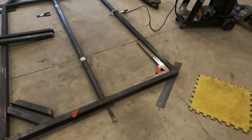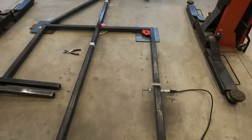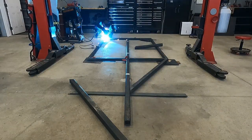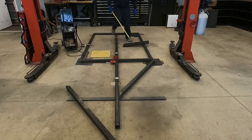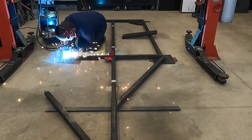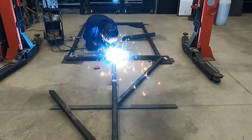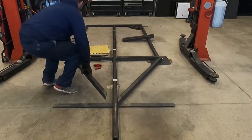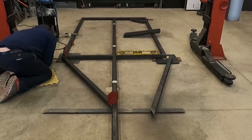Moving along, we'll do the passenger side frame rail next — same thing, use a framing square, make sure everything is perfect, using magnets and shims to hold things in place, and taking many measurements before putting the first tack in. Now that the body of the trailer looks like a rectangle, I can take cross-diagonal measurements before finishing tacking the rest of it in. Then I moved down to the neck of the trailer using the exact same techniques — shims, magnets, levels — anything I can to make sure it's perfectly square before putting the first couple of tacks in.